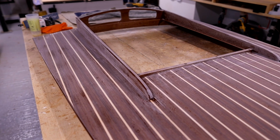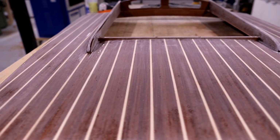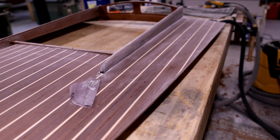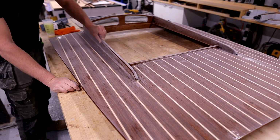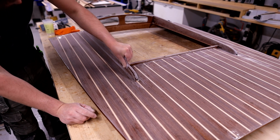the wood underneath. So day 2, the epoxy is cured nice and hard, and we're looking to just knock that back and take the top of the surface off. We're not aiming to sand back too far or too hard at this stage. What we certainly don't want to be doing is breaking through to the bare wood at any point around the part.